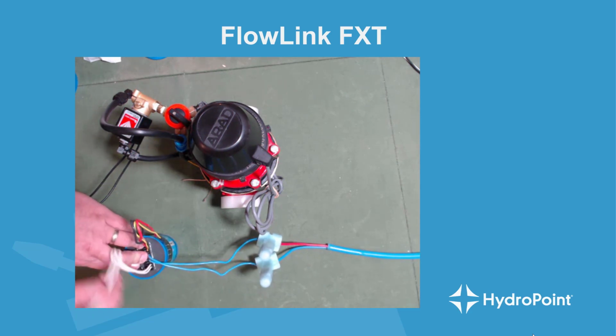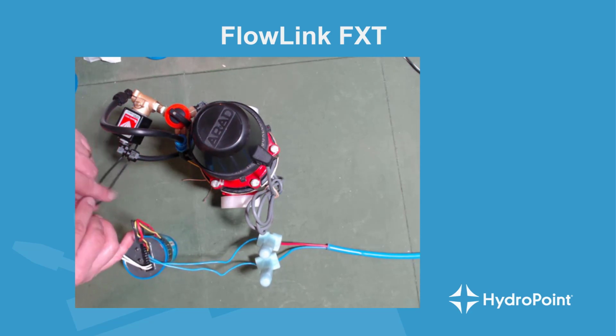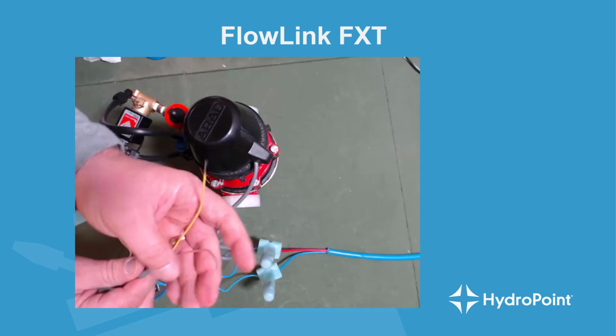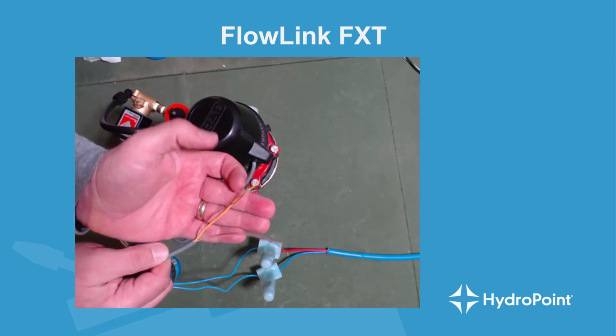Next, we'll take our two white wires from the FXT and wire them to the two black wires coming from the little black box that is the solenoid for the master valve on the Flow3. And once we've pushed those wire nuts in all the way to the top of the gel cap, so the jelly fills the bottom of the wire nut and seals out all of the moisture, we're ready to wire in our flow sensor.